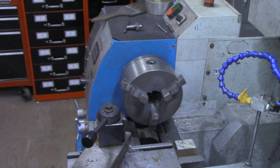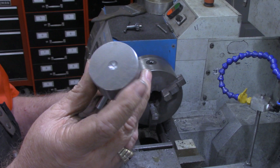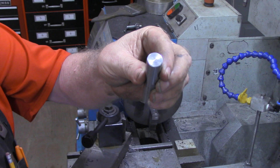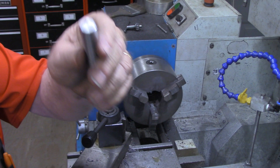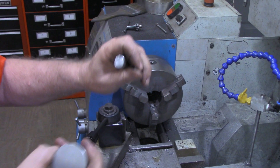Hopefully you can see that the lip on the head is flush with our set. I'm going to take this piece and do the same thing in the end of it. There's no reason you can't make these larger and put several different size divots in it, even on both sides. Your setter needs to match the head for one per rivet size, but your base for the header side can have numerous divots in it.